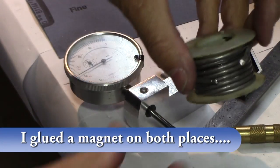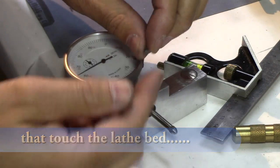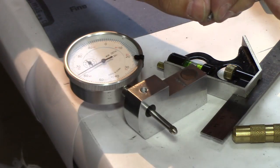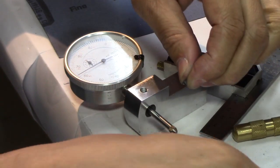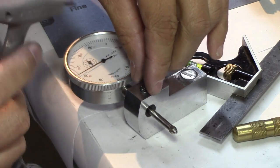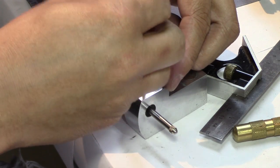I know my lathe uses a piece of lead ball in a set screw to keep it from marring up the threads, so I thought I'd do the same. I got some lead solder and cut off a little piece to fit down in the hole — that will keep the set screw from marring up the surface of the dial indicator. I also know that a slitting saw would have put more even pressure around it instead of one point, but I had to go with what I had.